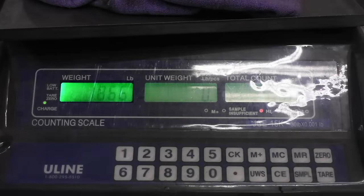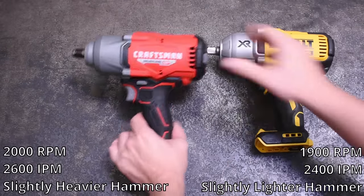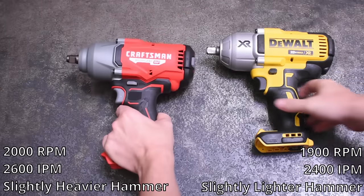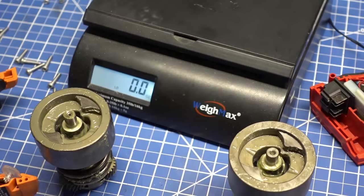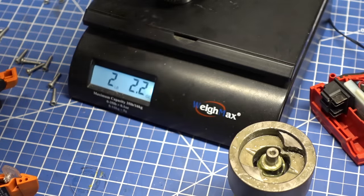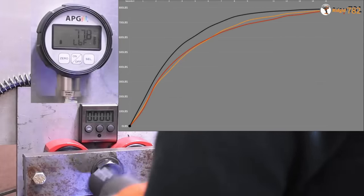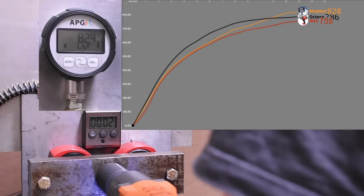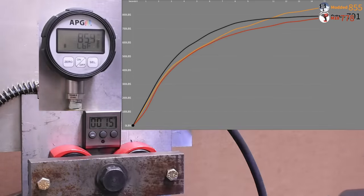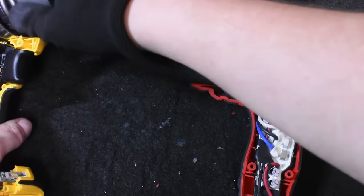The DeWalt's hammer assembly weighs around 1.8 plus pounds while the Craftsman's is more like 1.9 pounds — a bigger difference than we saw between the entire tool weights. Normally with a heavier hammer assembly, even slightly so, you see less RPM and IPM, but the motor on this Craftsman is not only able to handle slightly more mass, but drive that mass quicker than the DeWalt. We've seen the effects of mass differences before — the new Rigid high-torque hammer mechanism weighs less than the Milwaukee H96A version, and yet with more RPM it delivered about the same torque. Swapping the bigger Milwaukee hammer assembly into the higher-RPM Rigid created a compound effect, making more than either example alone — which is what Rigid would have offered if they were allowed to one-up the Milwaukee. You can do the same here and swap the Craftsman mechanism into the DeWalt, though not sure why you would since the Craftsman is cheaper to buy.